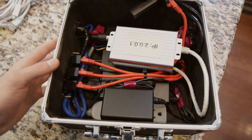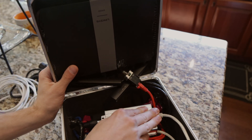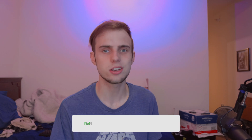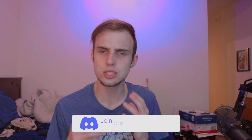What's up guys, Jack here with MTS. I have a little bit of a problem. The first network in a box that I built a number of years ago was in an old AKG microphone case, and it had a number of issues. For starters, it was using a consumer-grade Linksys router, so I couldn't do multiple SSIDs or VLANs. I only had two exposed POE ports, and none of the cables were locking — it was just using standard IEC and standard RJ45. So I needed to build something better, and I did.